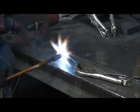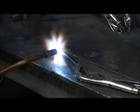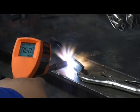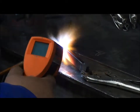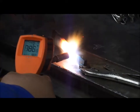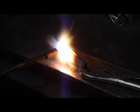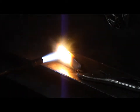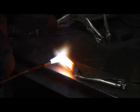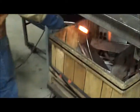This is obviously an extreme example of what happens if you quench steel that's too hot. You can see it's already over 1,000 degrees in different areas. We're going to keep going a little hotter just to prove our point. As you can see, it turns almost white — just over 2,000 degrees when it gets that way. Casey is going to go ahead and quench it now.